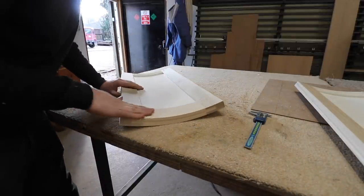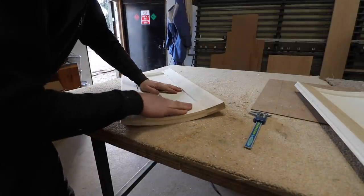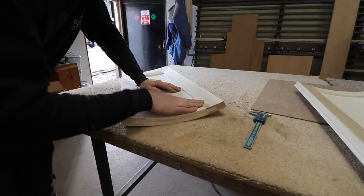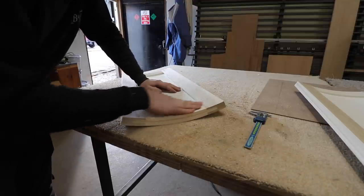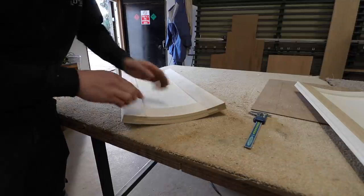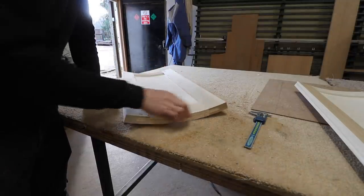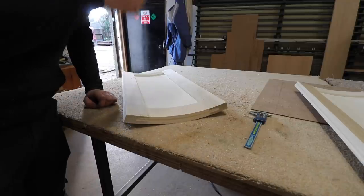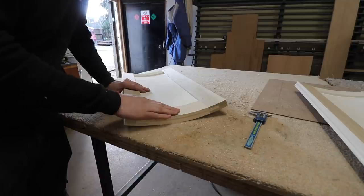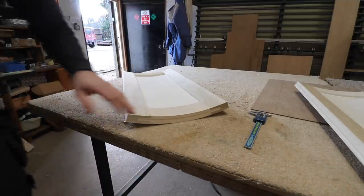Right, sanding these insides. I was going to just use a soft pad and let it sort of contour, but I think it's got a few little steps in places. I'm going to end up with a right wavy finish, it's just not going to be very professional. So I'm just going to cut, on the bandsaw out of a thick piece of wood, a sled to this sort of right inner curve. And I can use some low grit, like 60 or 80 grit paper, and just sand the rails in by hand.